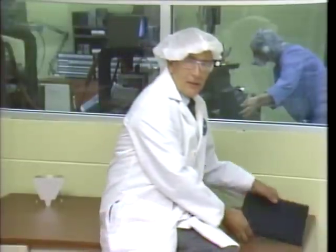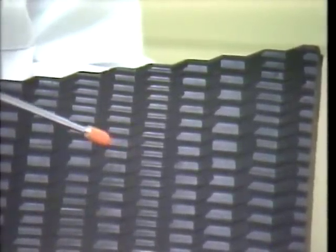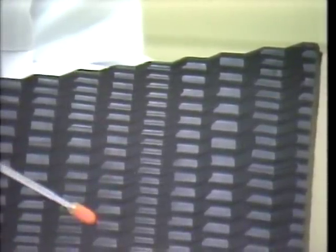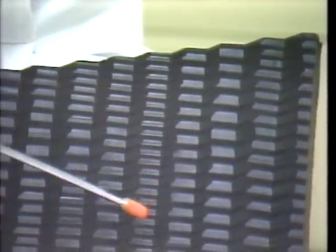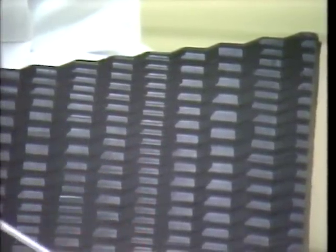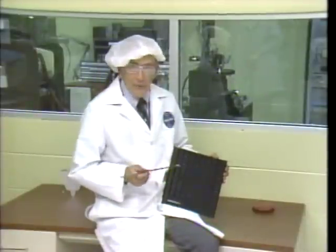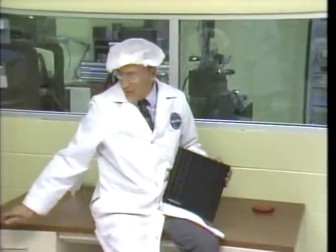To give you an idea of the dimensions we're talking about, here's a groove mock-up 10,000 times actual size. These are the undulations of the signal the cutter is vibrating 3 million times a second to produce. The player's stylus rides in the groove and reads the signal as it passes over the peaks and valleys. In contrast to this, which recreates 10 video disc grooves, one groove in an audio record would be about, well, the length of this entire table.